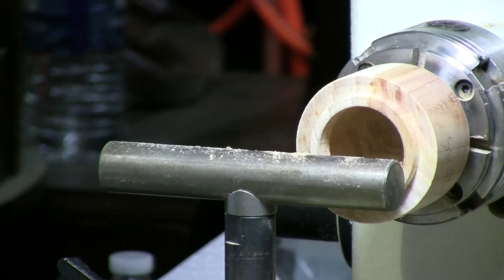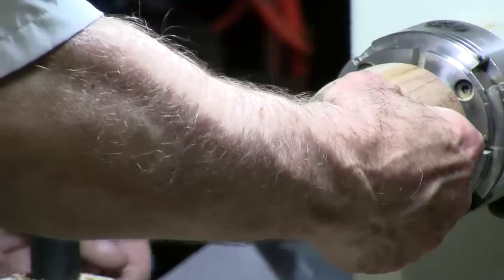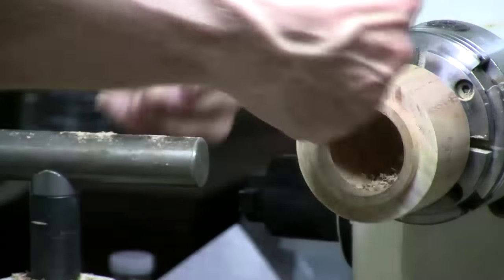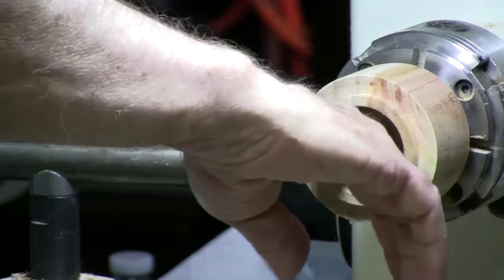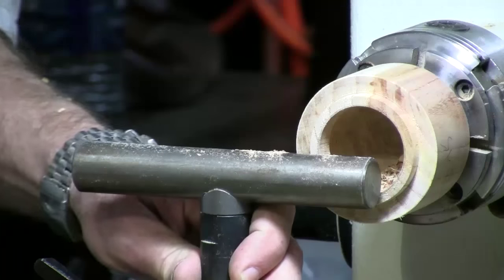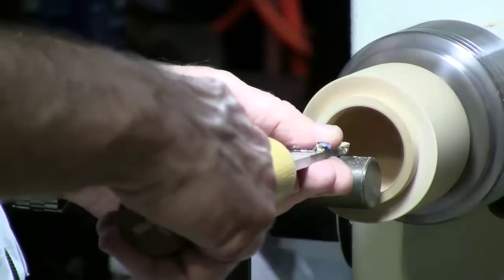What works for me is a little 6-inch ruler, and you just hold it up there and press it flat and eyeball it against the bedways and say, is it pointing in or pointing out? Typically, initially, it'll point out just a little bit because as you go in, subconsciously, you never press as hard at the back as you do in the front. So I almost always have to come back again and tweak it a little bit. Just don't cut any off the front.